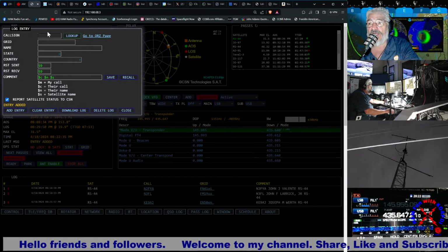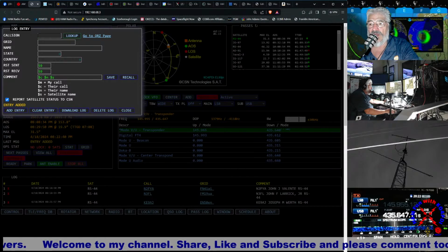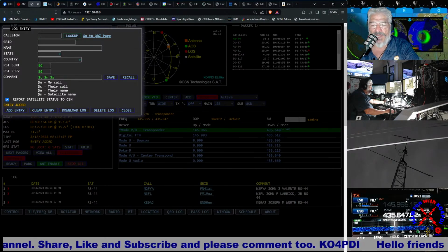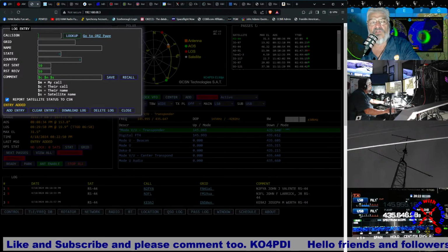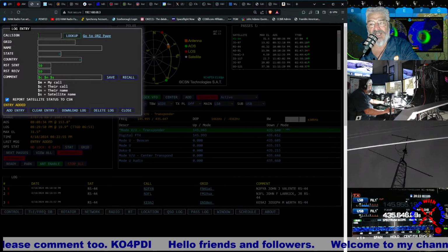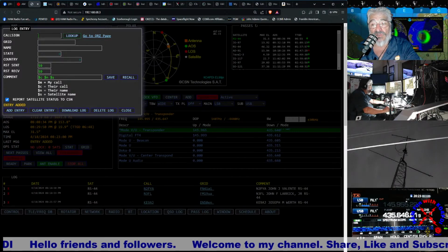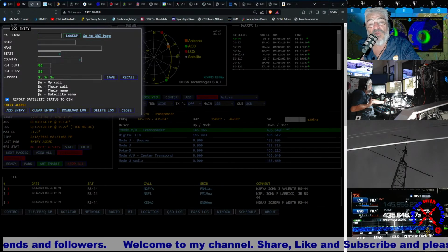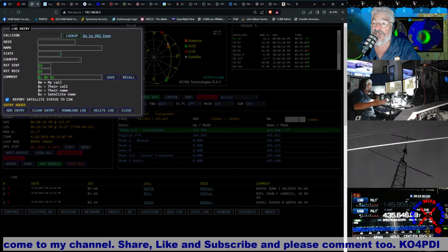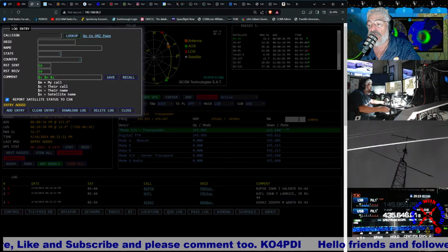I'm sitting on the frequency now. Let them come to me so I don't overdo it. So in this case, a circular polarized antenna would not make a difference. The reason is the RS-44 satellite is still attached to the second stage of the rocket that launched it, and it's rotating in the sky. When that booster is between me and the antenna, you lose the signal. That's why it keeps fading out, and when it comes back, you see how strong it is? Had it disconnected from the booster, it would be that strong almost all the time.